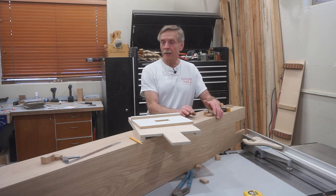The process for doing the mortises starts much the same way as it did for the tenons. I put some duct tape here to snug up the fit because this end of the beam was ever so slightly narrow, then flush up the other end of the template with the end of the beam and mark out the spot for the mortise. Drilling two relief holes comes next, followed by careful cuts with a small circular saw. The width of the mortise in relation to the blade diameter means I need to use a plunge cut to start and release the scrap. If you're not comfortable plunge cutting, just use a jigsaw for the whole cut.